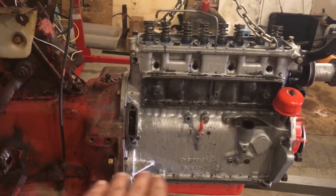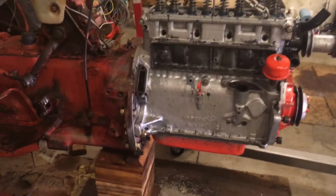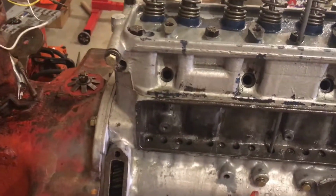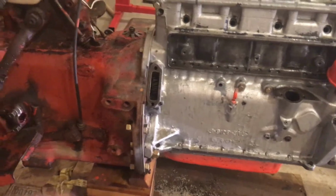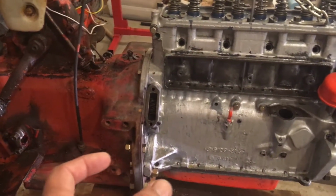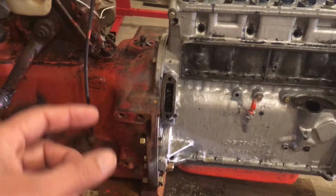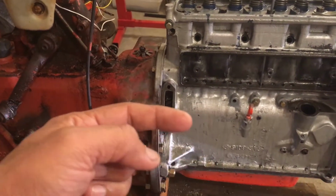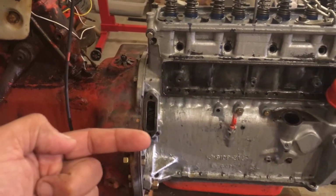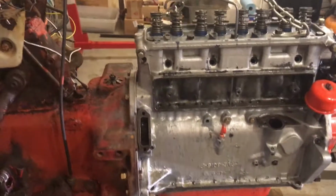Both sides were at equal height, and then I brought the engine hoist towards the rest of the engine, and I tried to push it as much as I can onto the transmission shaft and engine plate. The last few inches will not go easily if you just try. So before actually pushing them together, I rotated the transmission shaft so the splines were aligned in a way that it will go easily into the clutch plate splines. And I put some grease so it will slide easily.